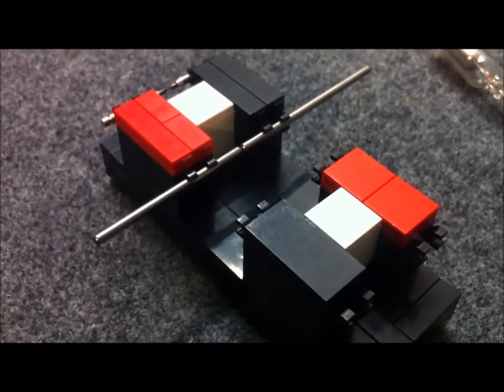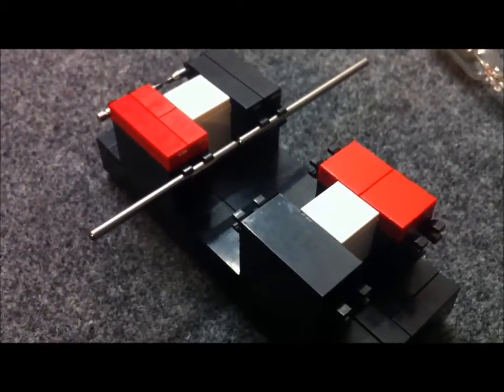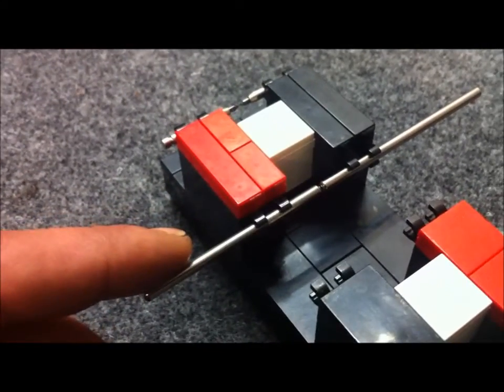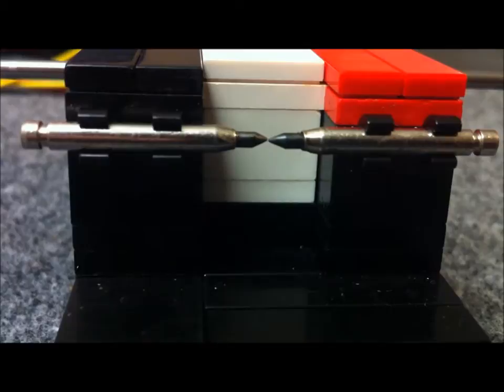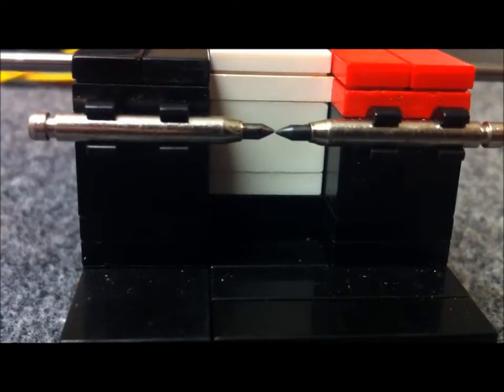We'll be using it a lot, so I plan on stripping it down and putting it back together with epoxy between every joint — that way it'll be one solid unit. You can use whatever electrodes you want. These ones actually came out of a fan from a microwave oven — I just punched the shaft out and stuck them in there. They work great, but I do prefer using the engineer's scribe tips because you get a more accurate gap, more finely tuned, and less erosion of the electrode surface.